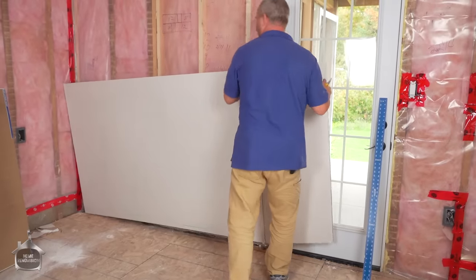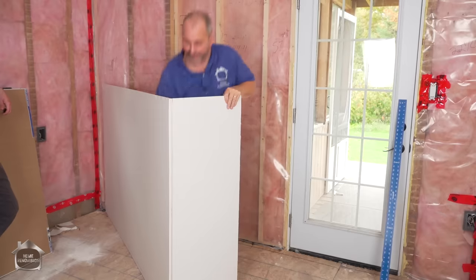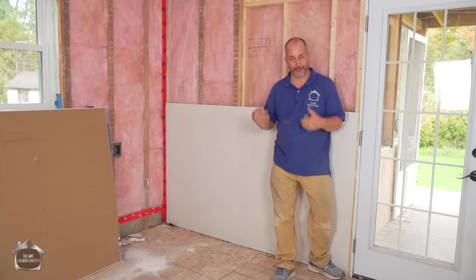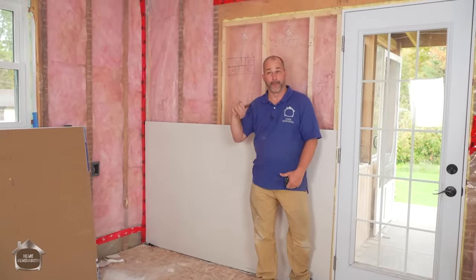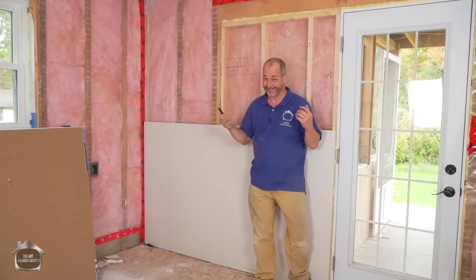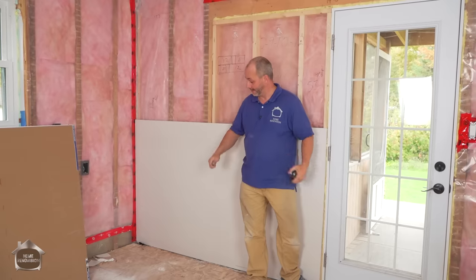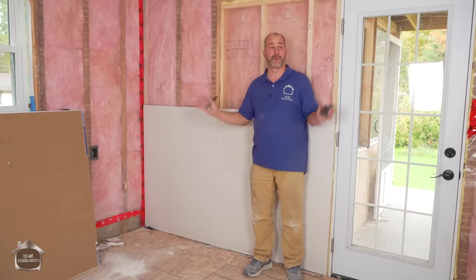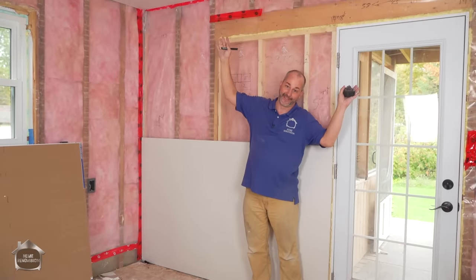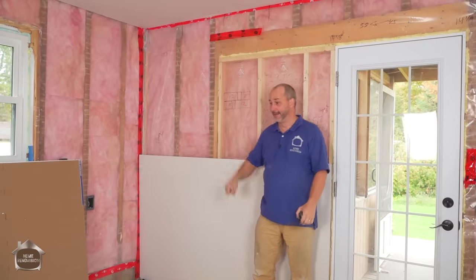Everything here is so crooked. It's our job to make it look straight. All right. So all that information about measuring is great, because generally we like to install tight against the ceiling. And that works great if your house is level. But in this case, everything is old and twisted and weird. So it's better for us to work here so we have a nice straight edge that we can measure off of. Because even once we put that sheet in there, we realized we were installing like this, and that same thing happened where things were too long or too short. It's just wacky.